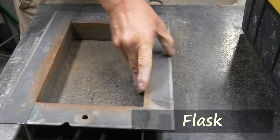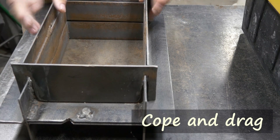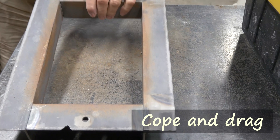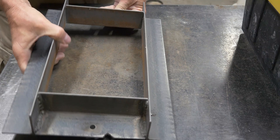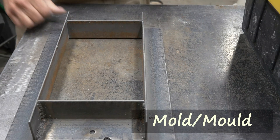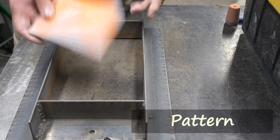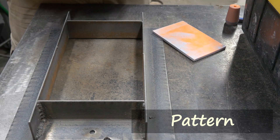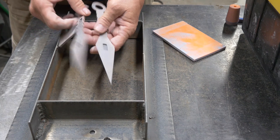This is my casting box, and a casting box is called a flask. Flasks are typically made up of two parts: the top part is called a cope and the bottom part is called a drag. If you have trouble remembering them, the drag is the thing you would drag across the floor — it's on the bottom. We'll flip the drag over and start to make our mold. What we mold are things called patterns, which are what we're going to make a part from. This is a single pattern. Sometimes you'll see larger patterns that are split in half — that's called a split pattern.